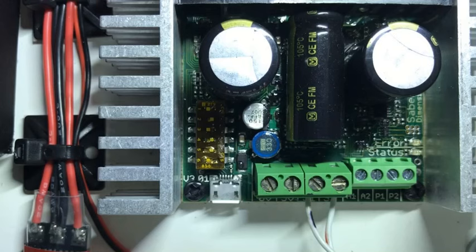So in order to do that, you have to have additional circuitry to kill it when you lose signal. So what I did is on my FlySky transmitter, I set failsafe for the channel that's used to power the relay to the failsafe on position. And when it goes out of range, it goes about 2 feet and it stops. I ran this for about 2 hours plus in this configuration. I had a few times that it did an overcurrent and rebooted, but it just sat there for a second, and then I had complete control over the joysticks again. So I believe I've eliminated this problem.